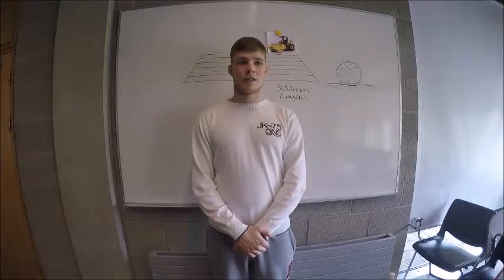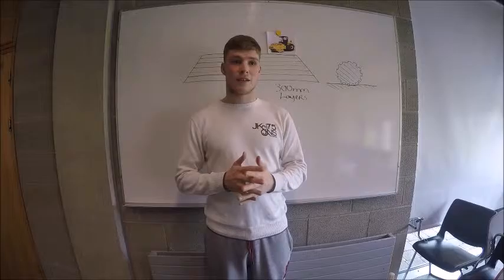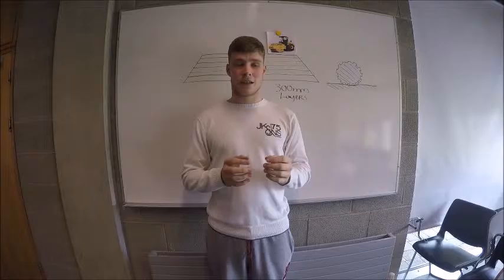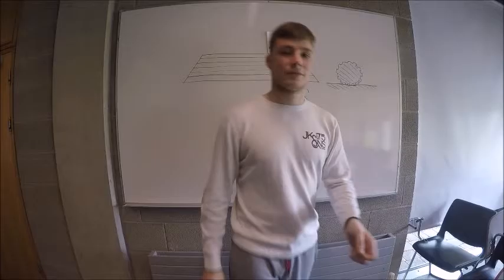The most important and meticulous stage of construction is compacting. Under the inspection of an engineer, the soil is built up in layers of 300 millimetres into the shape specified by the engineer. It is compacted using a sheep's foot roller, as can be seen here, to ensure absolute homogeneity in the soil — meaning equally dense in all areas. Compaction increases the shear strength whilst reducing permeability. The main role of the farmer is to provide the material.